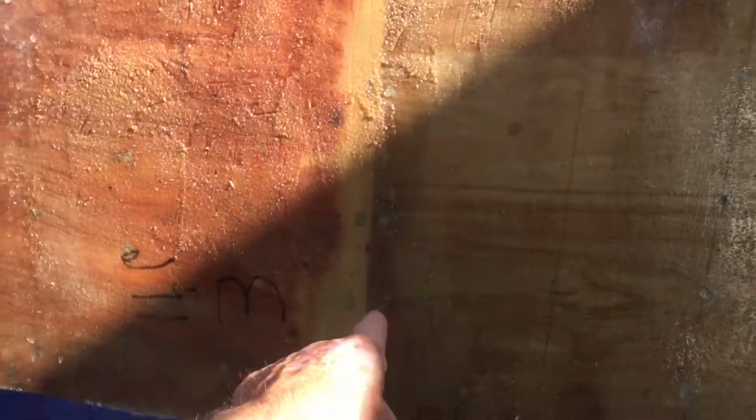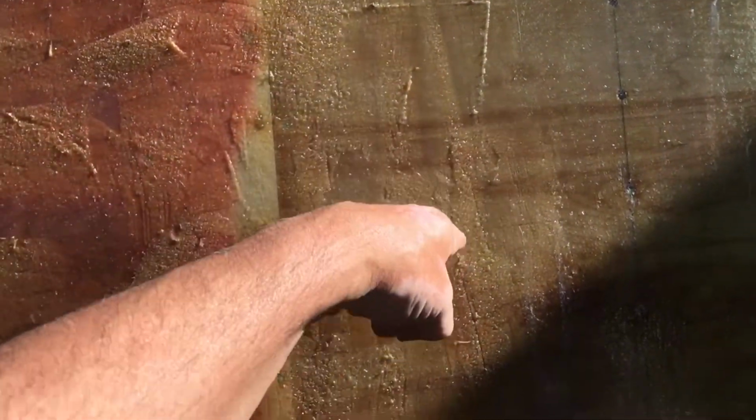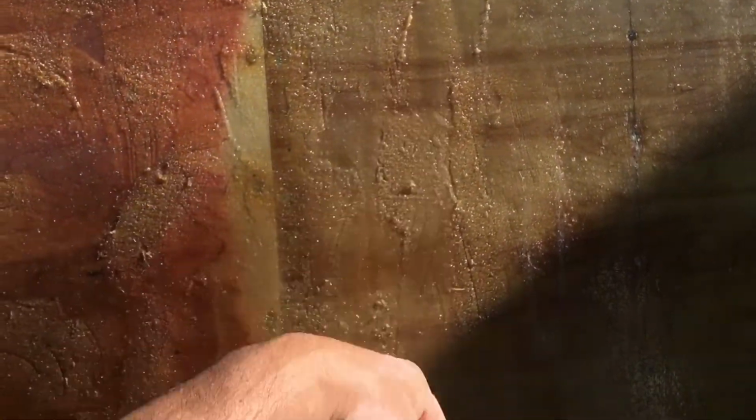I'm worried about filling. Okay, now my biggest scare here is that I'll have to sit here for 4 hours and try to sand it out. He says it sands out pretty decent, and I am presuming because the sawdust is in it, it allows it to sand easy. So I filled up a section of holes, screw holes, here. I tried to clean up a couple of dimples in here, more screw holes down here, and there was a void in here, you know, the overlap, and it only took so much, so I may have to go over it a second time. Okay, Jason, so I'm giving your suggestion a shot right here.